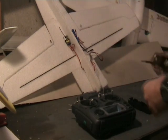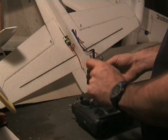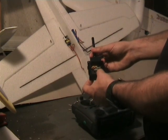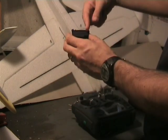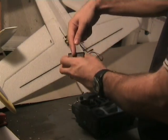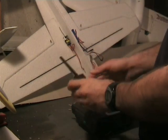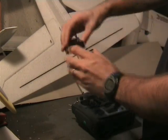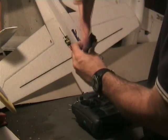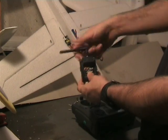There's one thing to bear in mind, and that is the module hasn't got a bit of reinforcement keeping the circuit board down on this side. It's only got a piece of reinforcement down on that side. So what happens if the pins, in the Turnigy for instance, aren't perfectly lined up, they tend to hit the circuit board, and the whole circuit board tends to twist at an angle and sit like this inside the remote, which stops the module from bedding in properly.